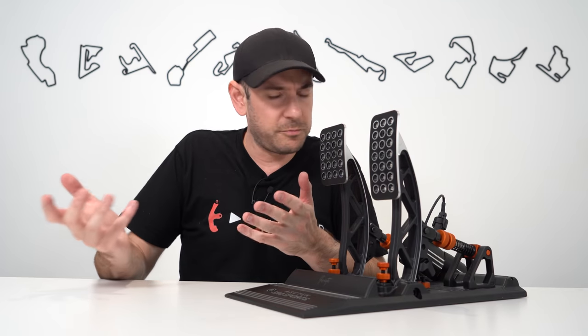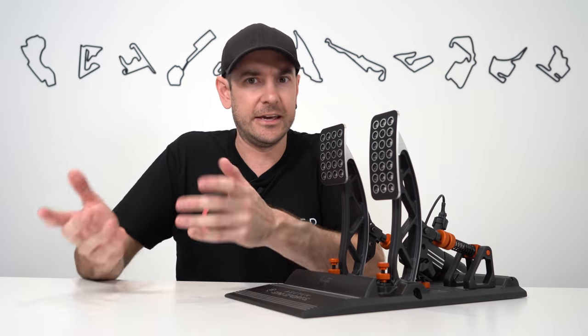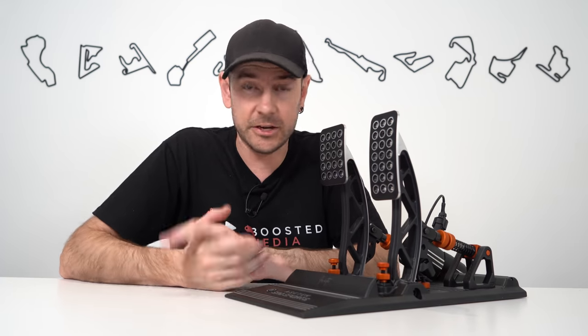So potentiometers aren't fundamentally bad, but if you're using a low quality potentiometer, something that's an open design that can take in dust and debris, it is going to wear out and change its input or its reading over time, whereas something like a Hall effect sensor is far less likely to change over time. It does add a little bit of complexity in terms of the electronics.